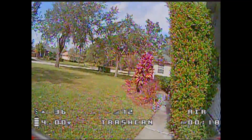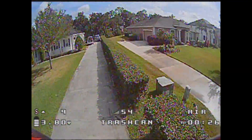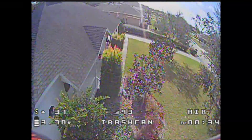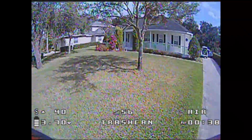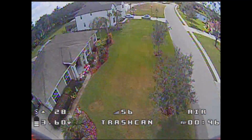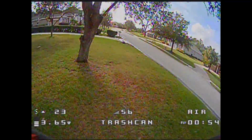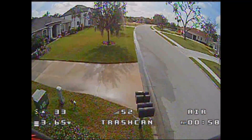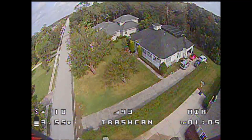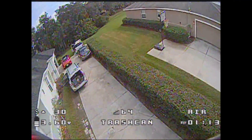Now we're going to look at some of the worst flight footage you'll probably ever see. The wind was blowing at a steady 15mph with gusts up to 25, so I'm just getting blown left and right. I did want to show the power of the 2S battery — it is a little more powerful, but you can't say you gained 50% power. It's not dramatic. If you want to fly 1S indoors, don't change to the XT30 — leave the JST2 on. You're not missing much, maybe five to eight percent.